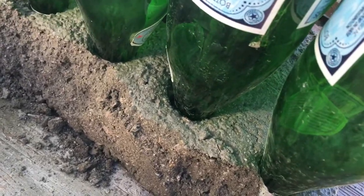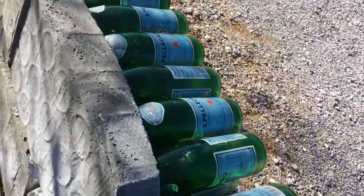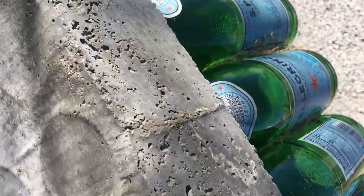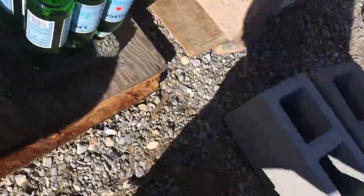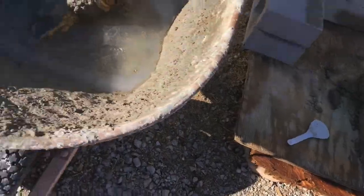As this dries, the inside will dry and get hard, but the integrity won't be as good. I'll show you some pieces over here — they're better. The integrity won't be load-bearing quality. See how the edges are supposed to look? This one is how it's supposed to look; this other one didn't form that well. So be careful when you're mixing concrete when it gets too cold, under freezing.